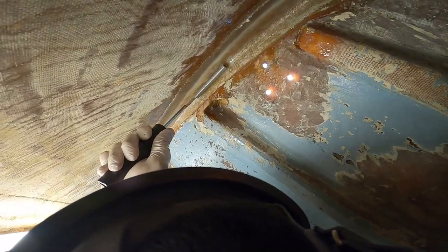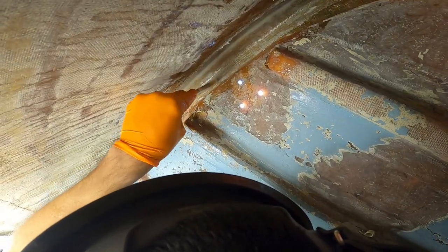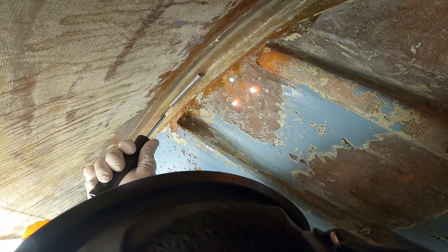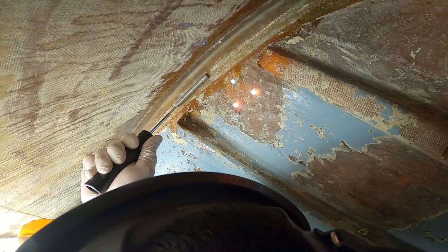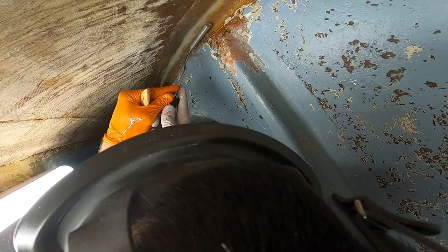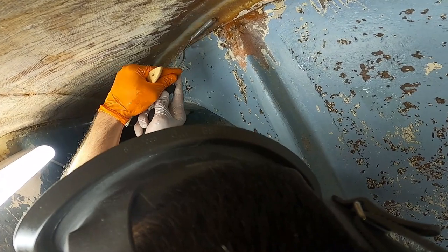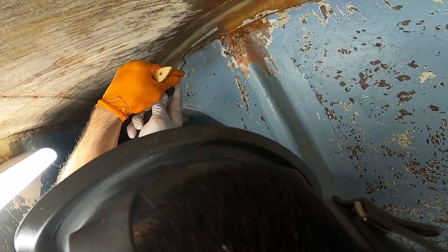And then following up, I go back over and I wet out my... So I measure the length that I needed. I mark it with a Sharpie on the side of the hole. And I go back out, and it was actually the width of that table that I was using. So I go back out, I cut my fiberglass tape, I wet it out, roll it up, go back in place, and then I can roll it out on the side of the hole, and then slowly work out the air bubbles. It took a lot of time, a lot of trial and error,